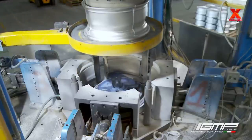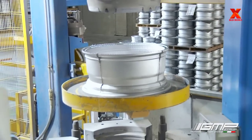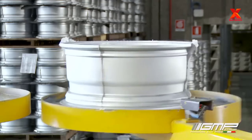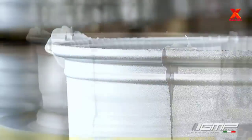The aluminium takes about 7 to 10 minutes to solidify, then the mold automatically opens releasing the newly cast wheel. During this stage you can see excess aluminium edges, which is one of the characteristics of the cast product.